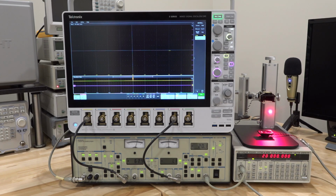And now, as a result of that, if you think about it, a speaker is also a microphone. It can also capture and absorb sound waves coming towards it. Those sound waves move the diaphragm up and down, they move the coil, and then they will induce some current and some voltage to be generated. So normally speakers don't make very good microphones, but here for simplicity I'm using an identical speaker at the bottom and an identical speaker at the top so that I can measure the signal this way.